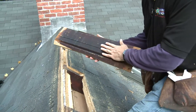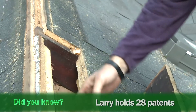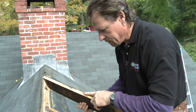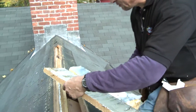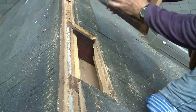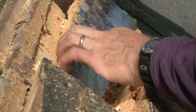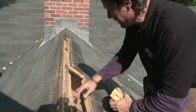In pulling the roof sheathing off, we see that, first of all, we have stain here. And we see that there are what looks like four by sixes as rafters, two foot on center. So at one point this ceiling was open, and all there was between the outside — the roof — and the inside — the stained surface — was three quarters of an inch of pine. There was no insulation at all. And then somebody realized it's cold in here, so they then put two layers of, in this case, polyisocyanurate foam insulation up against the stained surface. You have about an R20 there, but it's not air sealed. This foam insulation has got spaces on either side so air can still get through. We have a space between the bottom of the foam and the pine boards here, and I can stick my arm in here — and that's what we're going to dense pack with cellulose.